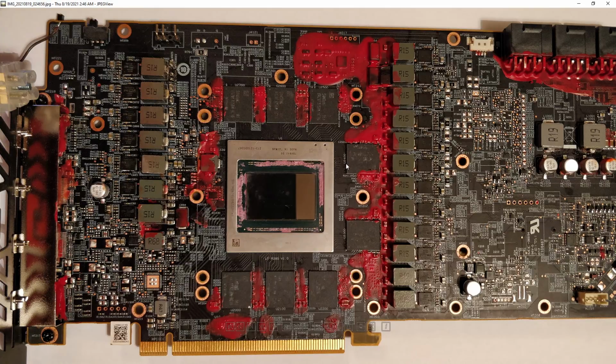And yeah, there's actually one other possibility that I can think of, which is that the power stage got too cold, because a lot of power delivery components have operating temperature ranges, and this one is relatively close to the core. At the same time, there was liquid water on top of the insulation in this area. So I don't think that power stage could have been much colder than sub-zero. It was frozen over, but I don't think it was all the way down at -40, because these are rated to -40 degrees Celsius.